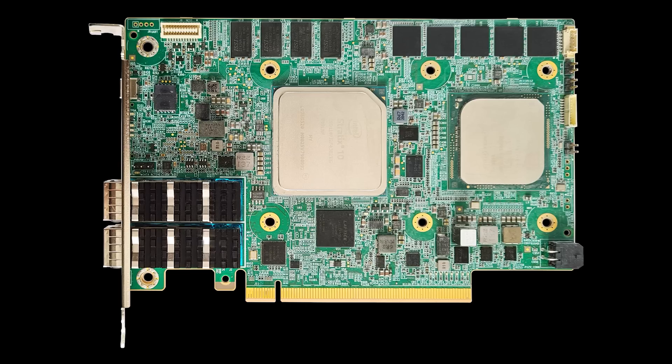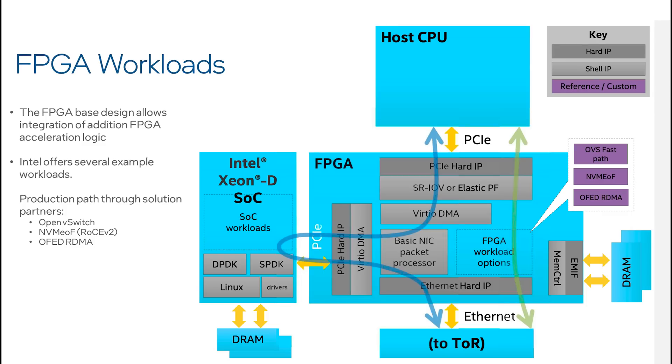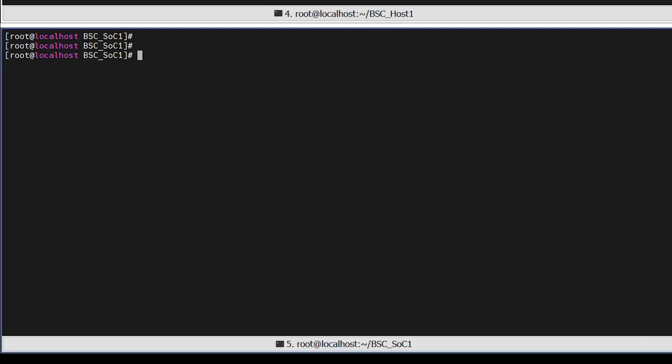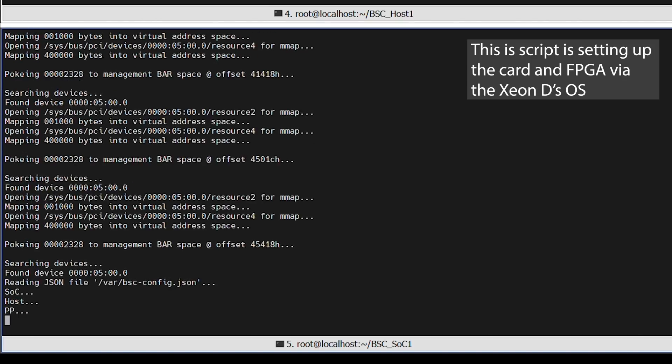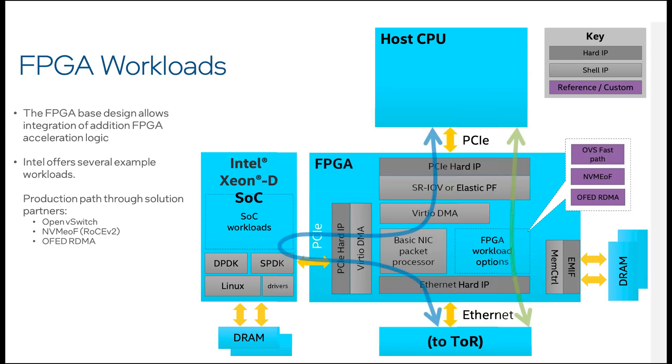Let's talk about what is on Big Spring Canyon, which is the IPU we're looking at here. We have two main components: an FPGA and a Xeon D. The Xeon D is the Intel Xeon D-1612 processor, a four-core, eight-thread processor that is really the control plane for the entire unit. It runs its own version of Linux, and it's basically what the infrastructure provider uses to provision services via the FPGA. The FPGA is the big deal — it provides all other functionality, with the entire data path running from the 100-gig network ports all the way to the PCIe bus.